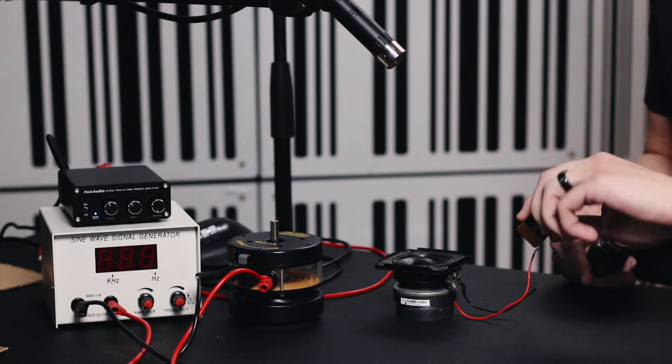This is technically a 0 hertz signal because it's DC. We hear a pop from the speaker because as it attempts to move outward or inward instantaneously, it can't really do that perfectly, which results in some higher frequency vibrations. But once it reaches its final position, we don't hear anything. In theory, I could switch the connections extremely quickly and we would hear an audible tone, but considering humans only hear down to about 20 hertz, I don't stand a chance.